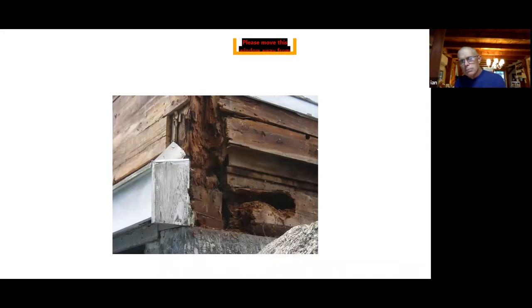Here's a corner of the Prescott barn. The trim boards were nailed on with 20-penny spikes — you knew there was a problem underneath, even before removing the trim. You can see the corner post is gone, and the sill going off the corner post in both directions is gone. It needs to be restored. Now we get into timber frame restoration.